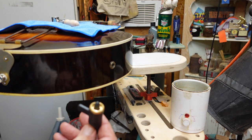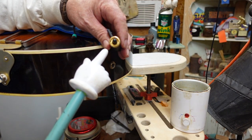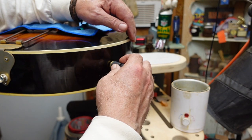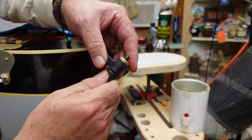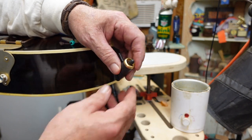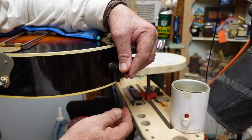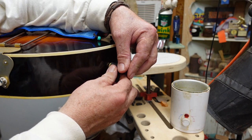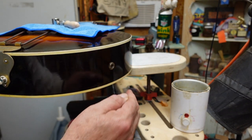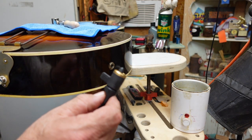This one is not as sturdy as the next one I'm going to show you, but what it does is, you see, it is like a socket right there. That brass part fits over the nut and drops on there. And then you'll see this rubber piece is tapered here, and it has almost what looks like threads on it. So you just clip this on here like so, and you hold this thumb screw, and then you just take this part and you can make sure that that's tight without turning the insides, because when this turns, wires break off, then you got a problem of using dental floss and fishing things through. This thing is pretty handy.